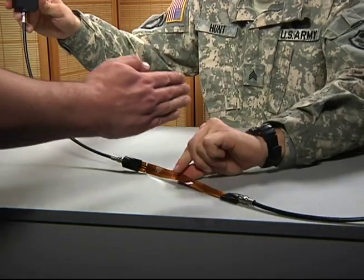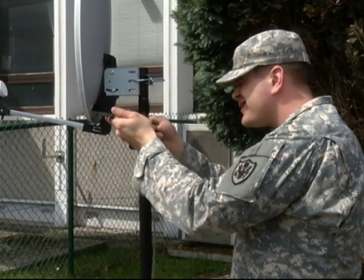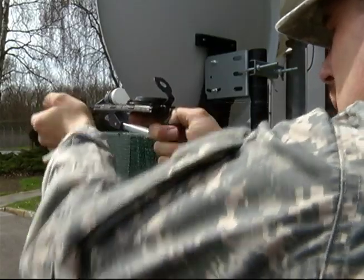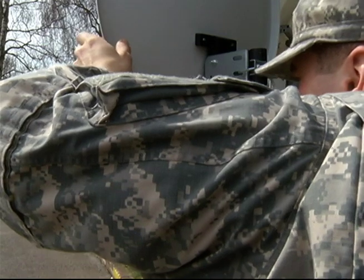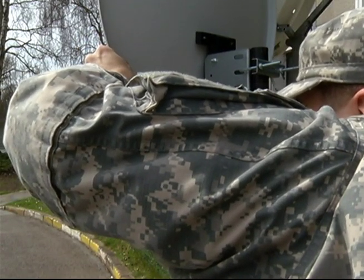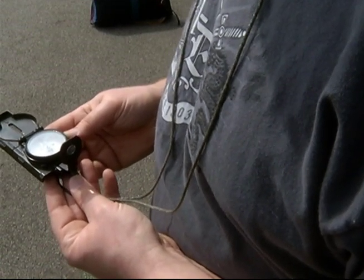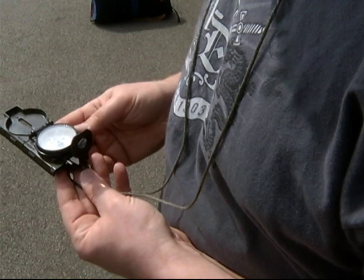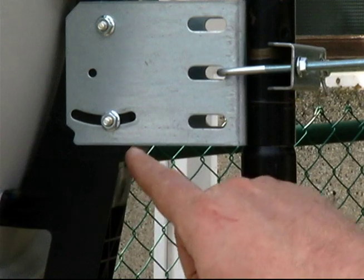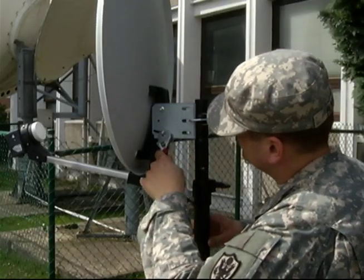Pointing the dish. Once the dish is mounted and the connections are made, you are ready to align your dish on the satellite named Eurobird 9A. You begin with the azimuth, or the compass direction, and elevation for the location listed below that is closest to you — 15 to 20 kilometers is just fine. Use a compass to select a landmark at the proper azimuth for your location, then point the dish as accurately as you can at that landmark. Set the elevation using the hash marks and pointer on the dish mount. This is only a rough dish pointing.